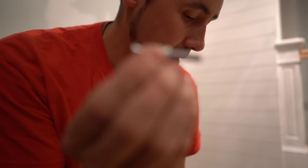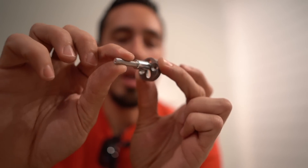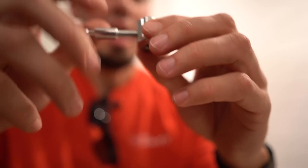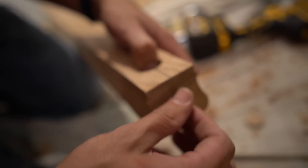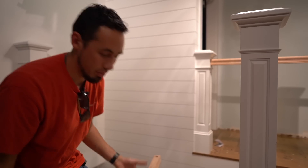Here's the deal with this little zip bolt slip-fix rail bolt system — I'll show you how this works. This isn't a sponsored video; I just picked this thing up today, first day I heard of it. You're going to get this little shaft, and it slides into this little slot right here. This is attached to the handrail, this is attached to the post, and this slides right in. To get this attached to the handrail there's this metal body and it's reverse-threaded — so when you're loosening it, lefty loosey, you're actually making it tighter. This thing drops in and then you fidget around with it until you get it threaded. And that's pretty much the system we're using.